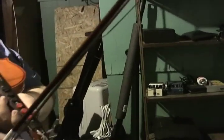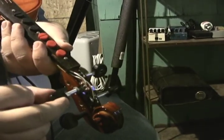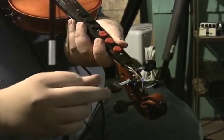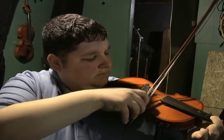But this knob here, as you can see, it looks like a tuning peg, but it's actually a knob. And as I turn it, it's changing the mix from being exclusively the raw sample of John Cage talking to a sample that has an effect on it that will pull out the nearest pitch in a major scale and play the same envelope with that pitch. So it's going to sound like some warbling pitches that are very similar to what you just heard John Cage say.